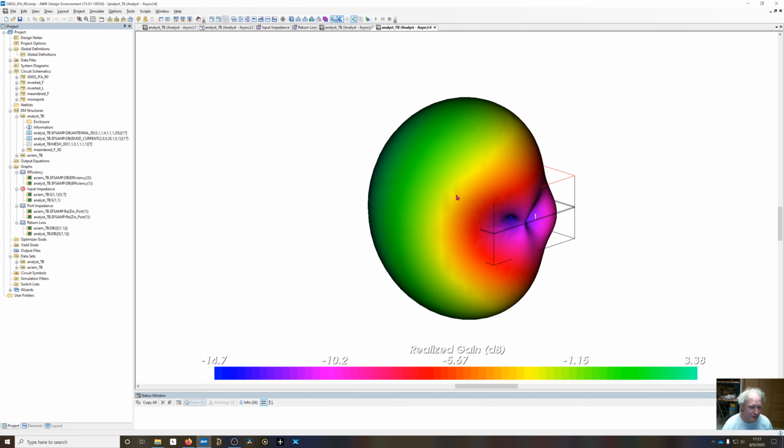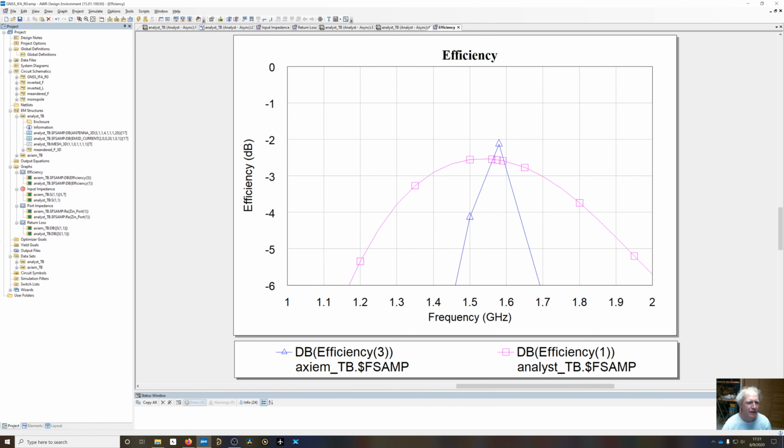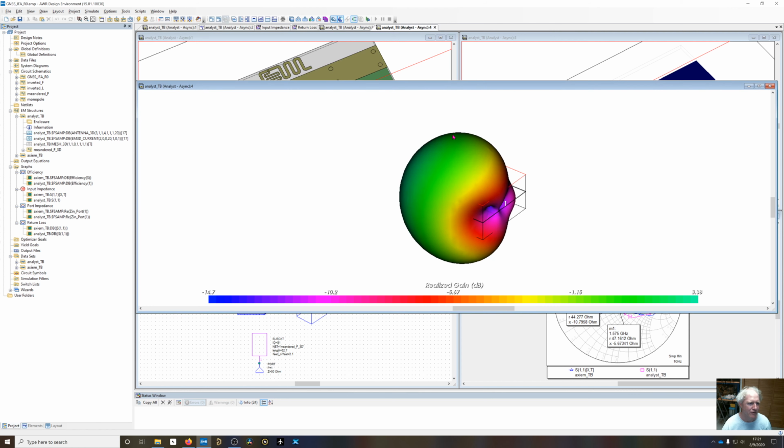So yeah, ideally in GPS you want to have good right-hand circular polarization and an antenna pattern looking up at the sky. But in, let's say, handheld devices, let's say a phone, you're going to have a random orientation. So the metric you really want to look at is efficiency more so than polarization, because you can't control the orientation of the phone. So you want to try to maximize the efficiency rather than throw away something to maximize polarization and orientation, which you really can't control.